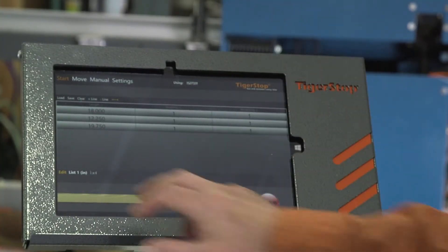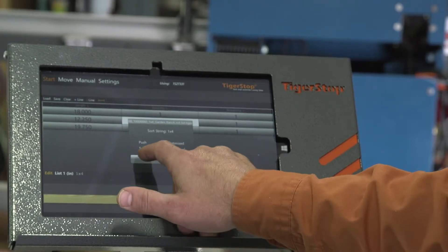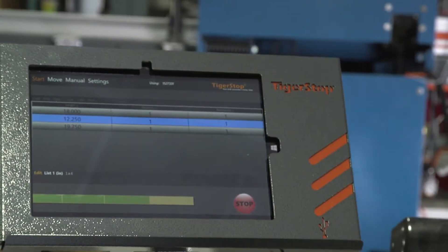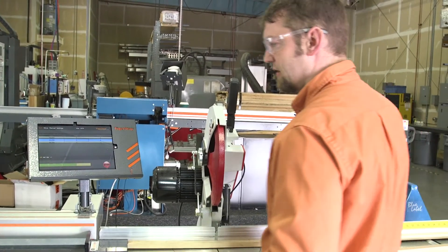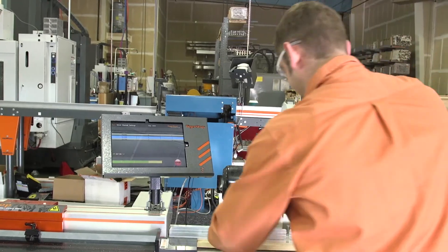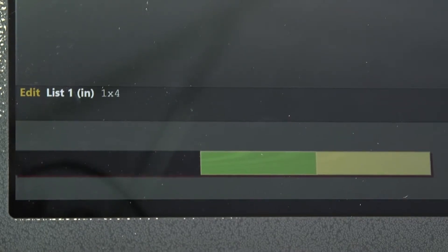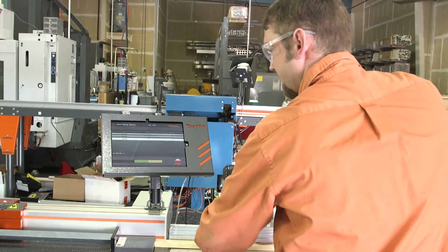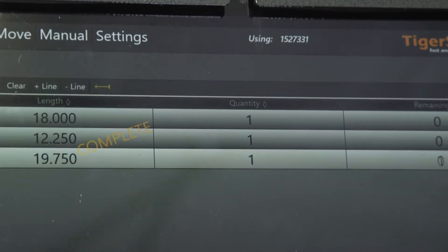Now we only have the three parts. We're going to take a look at our list, change it, make sure it's a set point — again, it's optimized. We're good with that. We press start, give in our stock length again. In a set point list, it's going to move forward to that set point position, assuming you've already made your head cut. Any cuts that we make will be parts at this point. It shows your full board optimized on the screen. As we're cutting parts, it's pulling the parts off of the list. It darkens where the part was. And that list is complete.